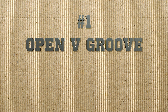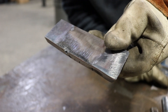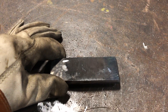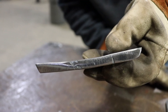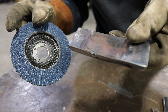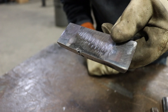Let's start with the first test here at Elite Welding Academy — the open V-groove flat plate weld test. The coupon is fully prepped and ready to go. As I flip it over you can see that the cap is fully ground down flush with the base metal, but you have to be very careful not to thin out the weld zone and make it thinner than the base metal. A useful tip is to use your tiger paw along the sharp edges of your coupon — this will greatly reduce the chances of cracking along the edges during the bend test.